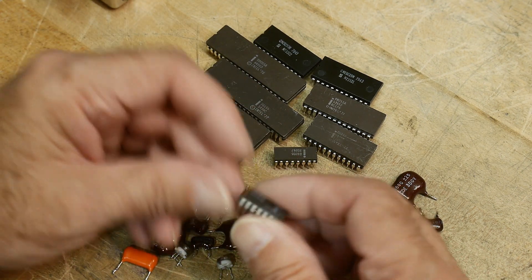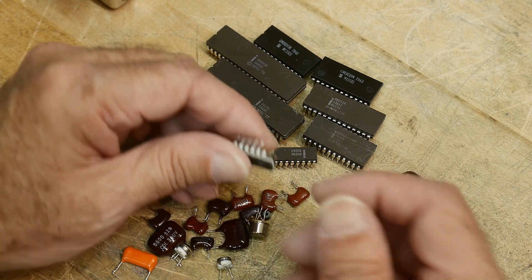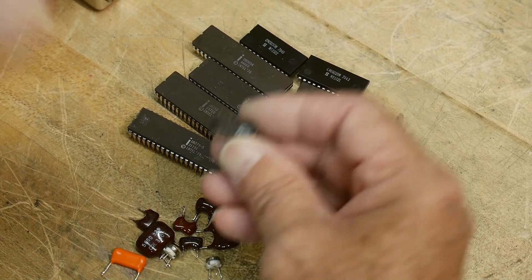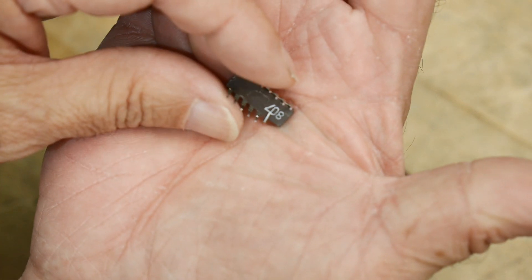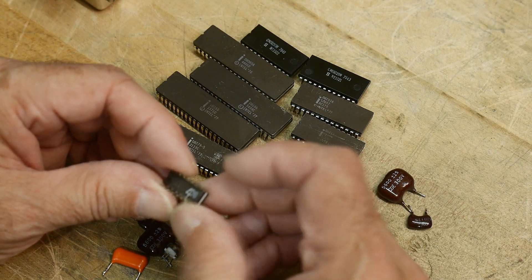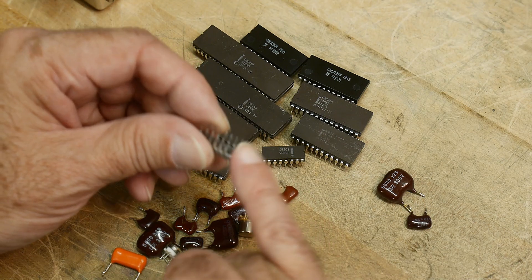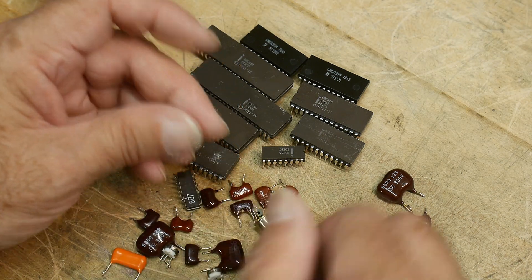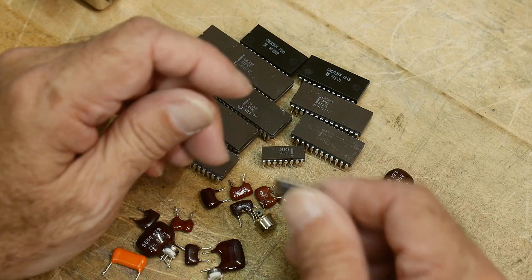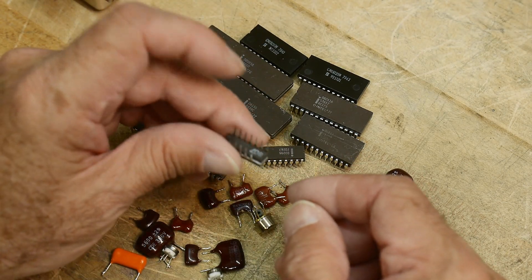This is just a 74-74. I took one of the legs off of this, and in taking the legs off, I don't know if you can see this, but one of the pins was bent underneath. So this was a failure on the board. I don't know if it was actually making contact with its little nub or not, but it never made it into the board for a complete solder. It was not on the socket — it was soldered into the board, but it got folded underneath.